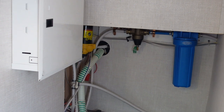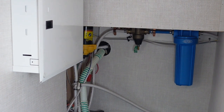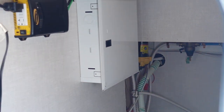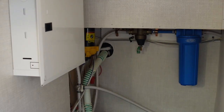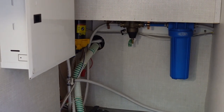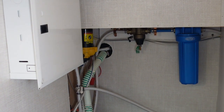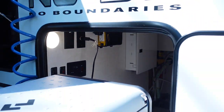Directly to the left of the blue water filter is a water pressure reducing valve — a PRV. At a lot of campsites the water pressure is really high, and you'd typically need a cheap inline regulator on your hose, but those are poorly made and can reduce your overall flow. This is a residential PRV, so it performs just like the one in your house. It's already built into the unit, so you never have to worry about high water pressure.